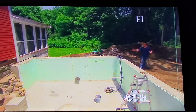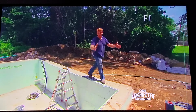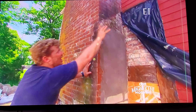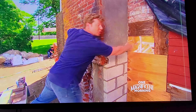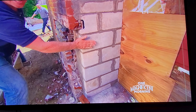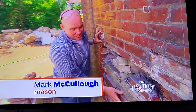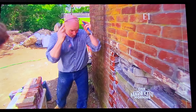Out back we are building a family room addition. You can see that the foundation is already set. But before we start framing up on top of this foundation, we've got a little bit of masonry patchwork to do. This big chimney right here — our mason, Mark McCullough, actually cut off this right side because the wall for the addition is going to come right in here to the old house. He's cut it away and started patching with some block. But right here we are going to see all of this, so the patch process is a little different — we have to take all this out, we're going to sawtooth this edge, starting with a hammer and chisel.